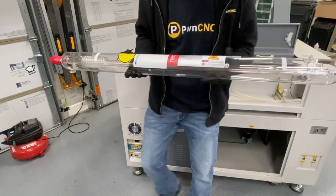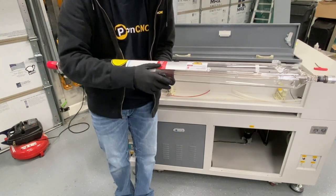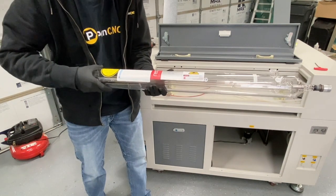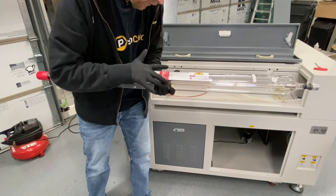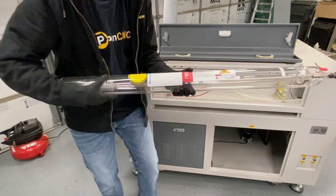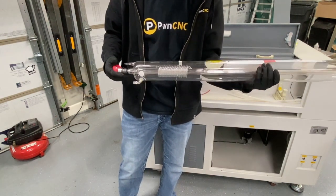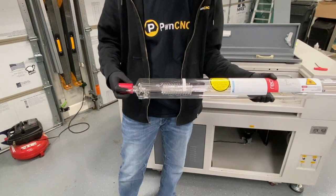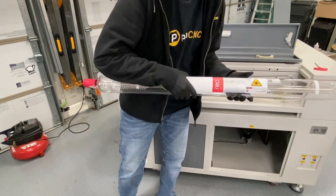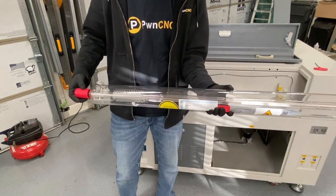I have the tube here. I put on some latex gloves just to make sure there are no fingerprints on the outside — I don't know if that's important but just to be safe. I've got a RECI CO2 laser; the rated power is 90 watts. The ground is over here and is not exposed. Over on the other side we have a rubber grommet — I believe this is where the positive goes in. The plastic cover will protect it. We've got a water inlet valve and a water outlet valve over here.